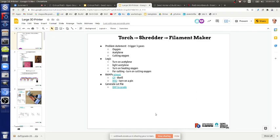So 3-inch shaft, put the square tubing on it, and mount the blades through the square holes, so you don't need any set screws. It's good to use a geometrical shaft so that you don't have to worry about set screws, otherwise the blades slip. In a heavy duty application like a shredder, you want a shaft with a geometry like a hexagon so the blades don't slip, because there's a lot of force on them. Otherwise every single blade would need a set screw, which is impossible to do.